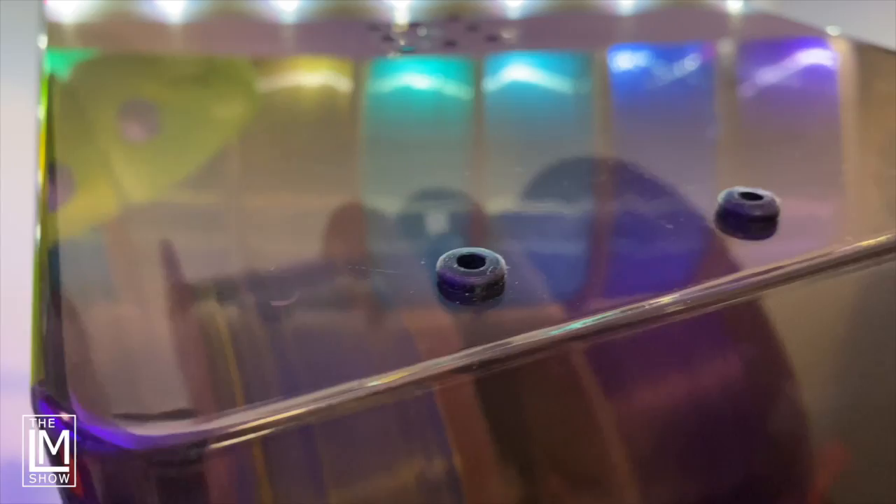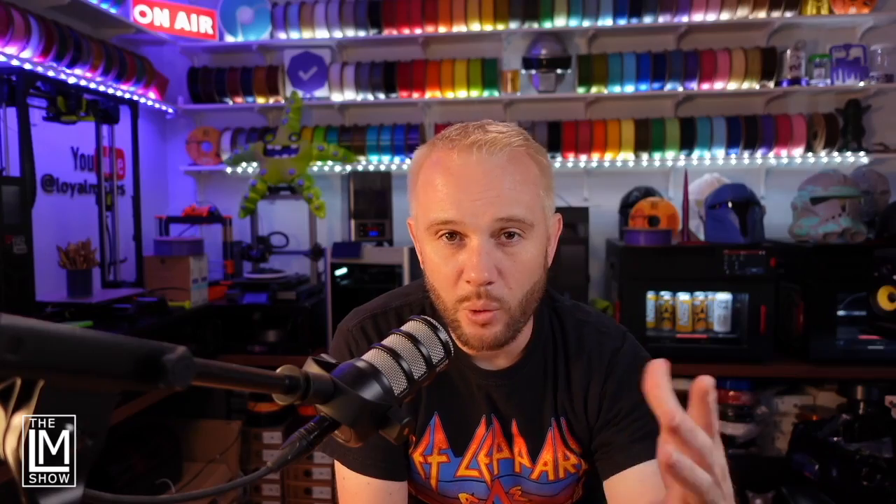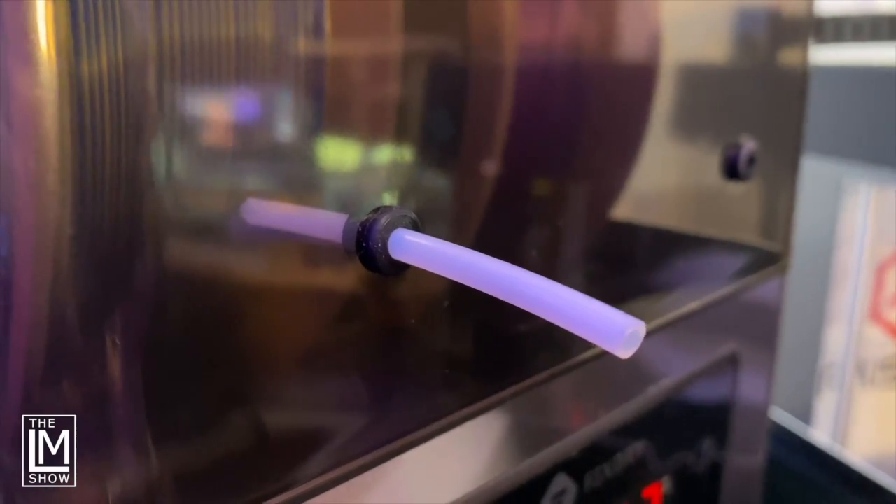FixDry sent us a two-spool filament dryer, which is kind of nice — it can feed two printers at the same time. This particular FixDry has 10 ports: six on the top, two on the front, and two on the back, and those are pass-throughs for filament. You can put PTFE tubes through them or just feed the filament straight out. It's a good idea to use a short piece of PTFE so the filament isn't rubbing on the rubber grommet — less friction and it'll last longer. You can print directly from the FixDry into your 3D printer.